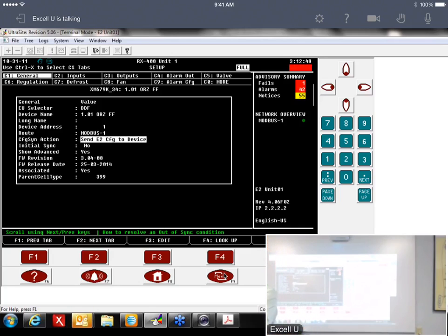Well, you can, but meat is going to be a hot gas defrost, or it could be. No, this would be CCD. It would be time off. Well, I think all the Publix stores are just using electric on all case control. CCD. Yeah, except for the dairy, they're time off, and produce. Meat is electric. Yeah, they are electric. So we would just need 3 of them: medium temp, meat, and a frozen food.